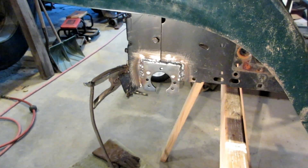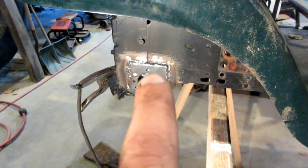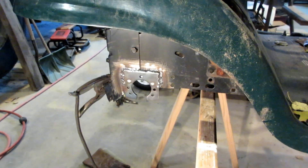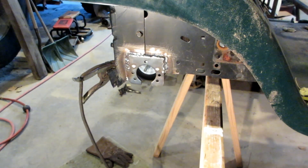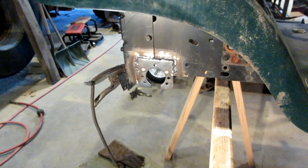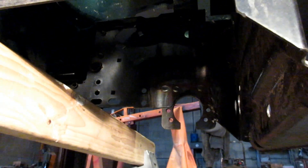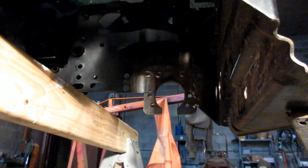It's on there and it's definitely not going anywhere now. I have it welded on the front and the back. I just have to drill that hole through the lawn mower frame so I can get the bolt through there for the bearing holder. I'm a little bit out of practice for welding, but it'll take maybe another couple passes to get back in practice. The metals are definitely melted into one. On the other side, I used a few of the chassis holes that happened to line up as some more rosette weld spots. Definitely not going anywhere.